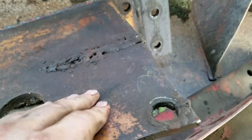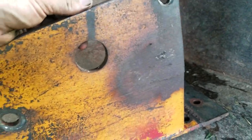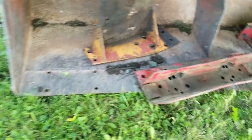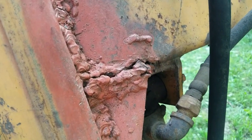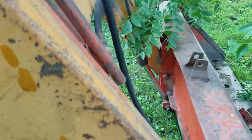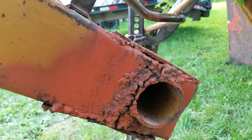That bolt hole is even cracked, and this has been fixed. Both of these bolts — none of them were tight. This one is cracked in the same place. And this obviously wasn't the right mount for an Oliver large frame. It's all boogered up — cracked up here, cracked down there, welds are cracked, crack everywhere.